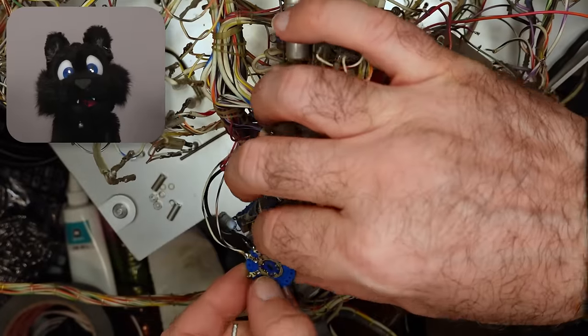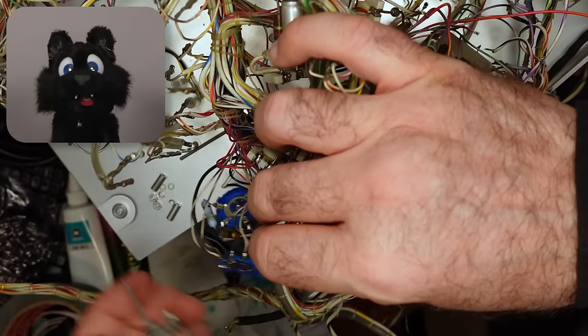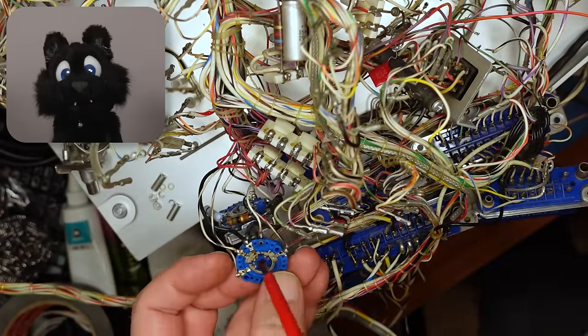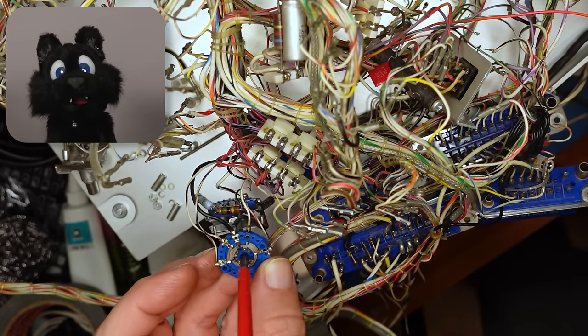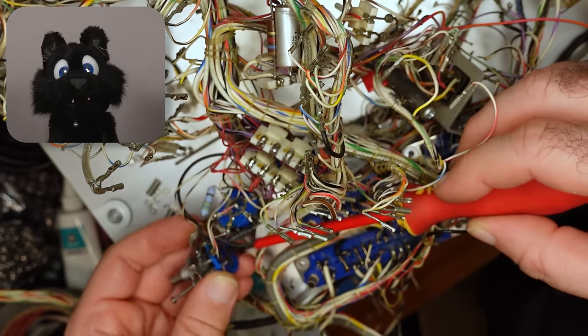Now for the rest of the wiring loom. I kept some of the selection switches connected, the step generator options for one. It selects the number of steps as well as the current limit for the base voltage ranges. As usual, I double check the correct alignment of the discs with one or two key positions with the schematics.